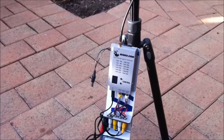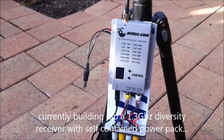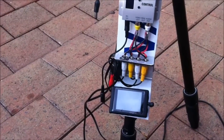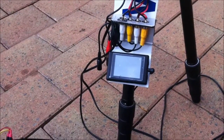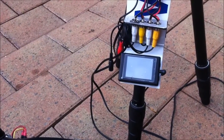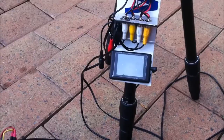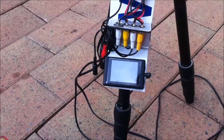Now we'll start off looking at the ground station. Here we've got a 1.2/1.3 GHz receiver running up to the patch antenna — all pretty standard. Everything comes off that and runs into the BEVRC DVR. It's a great little thing to have, especially if you lose your aircraft — you can go back and see where it landed. If your OSD heads-up display is showing at the time, you can even get the coordinates of where it's crashed, which makes things much easier.